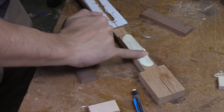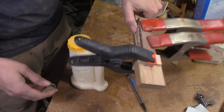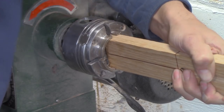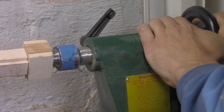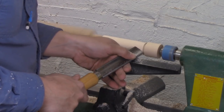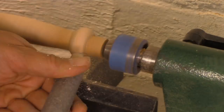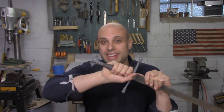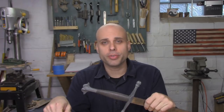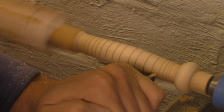I liked the turning so much I decided to do the same thing with the hilt, but I needed to thicken it up first. So I added some pieces of wood to the hilt and chucked it up in the lathe. Having a center line and leaving the whole thing rectangular helped me get it registered in the chuck and bring up the tail stock accurately so the whole thing spins true. My basic hilt design is simple, so I'm just using a roughing gouge — I want it to swell in the middle where your hand grabs it and be narrow on either end. Down at the bottom I'm making a little bead detail called a pommel, which keeps your hand from slipping out, especially if your hand is slick with sweat and blood — or if you're a five-year-old and your hand is slick with pudding. I then use the skew chisel to texture the hilt to improve the grip and make it look cooler.